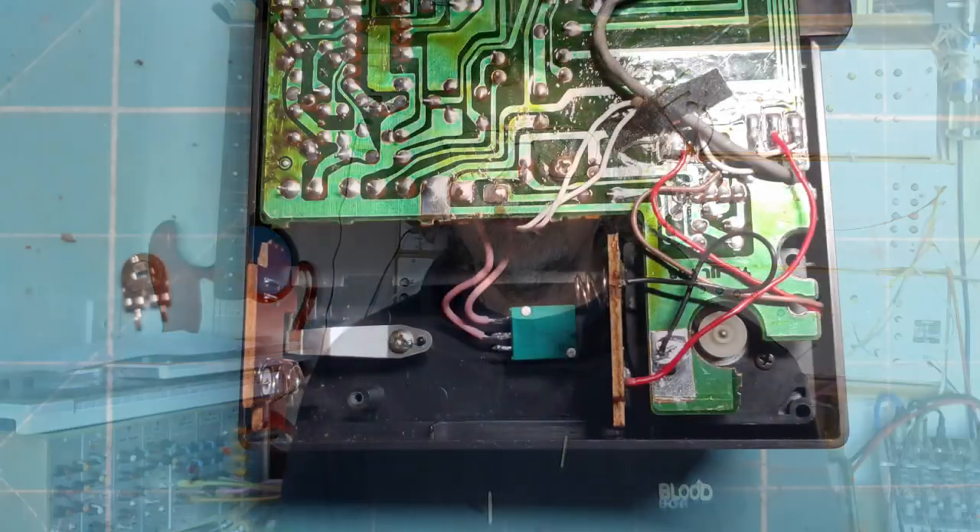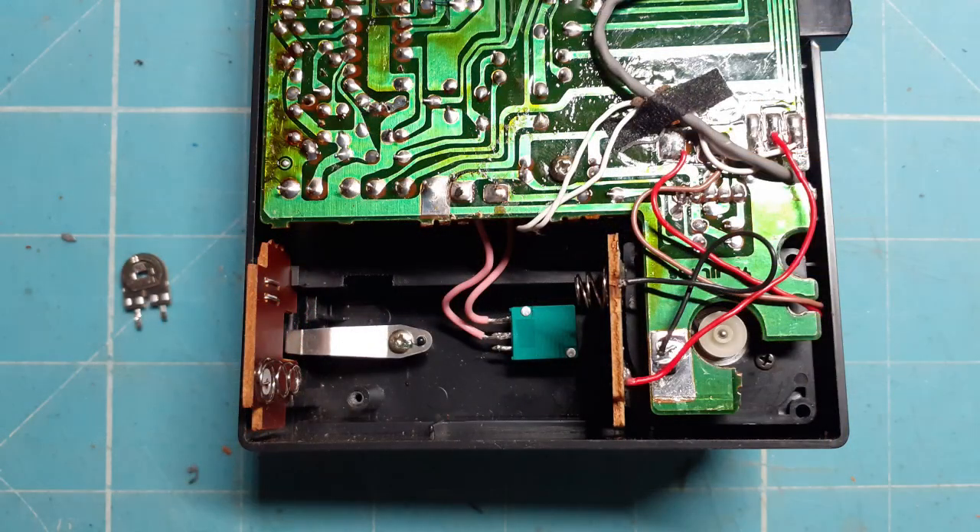If we look inside this particular cassette player, it looks like this. Unfortunately I didn't take a picture of it with the preset in place, but this preset at the side came out of this position on the circuit board. This is a very simple one — it's a two-leg preset, so it's just a variable resistor. It doesn't have three legs like most potentiometers, but you can just replace it with an ordinary potentiometer and use two of the legs to get a variable resistor.